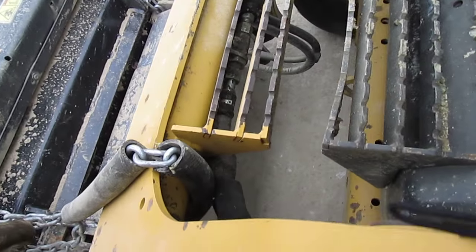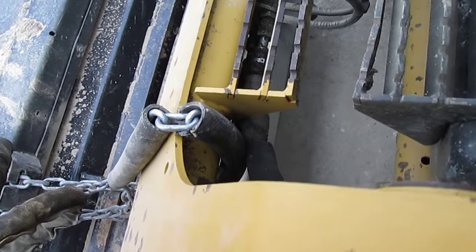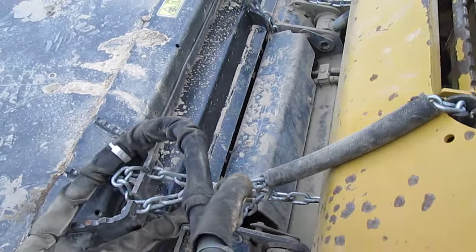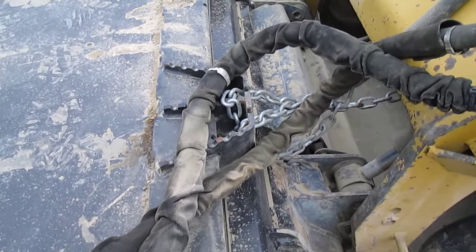What's really important is the way the chains go up around here on the boom — they go behind the hydraulic hose. That's going to be the most important thing to make sure that when this is strapped up, the chains go back around or away from the hoses.